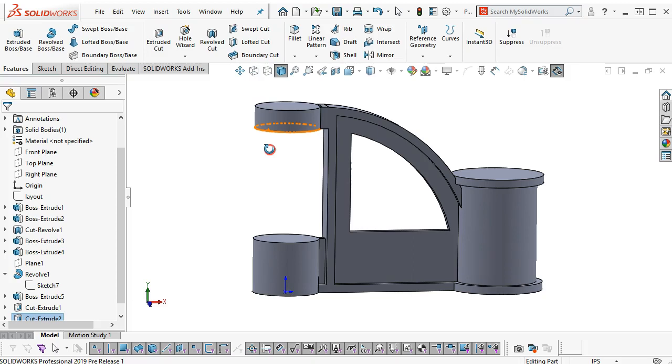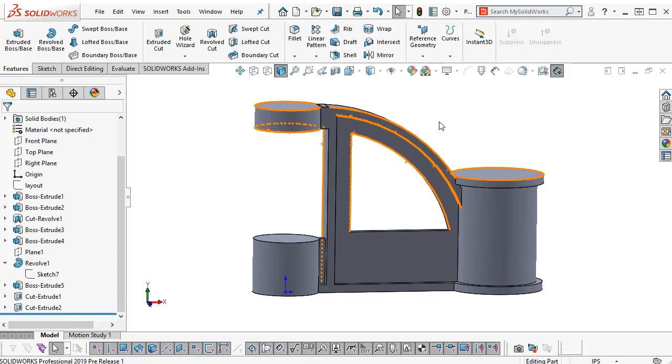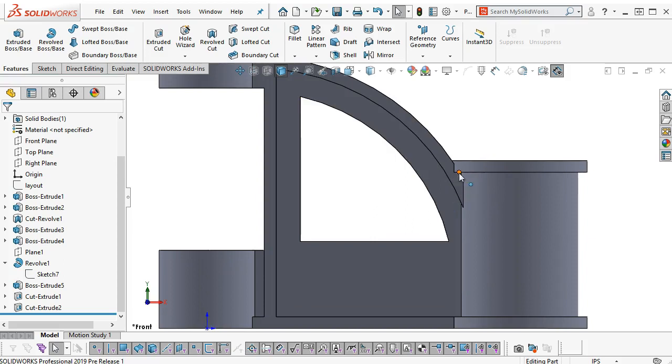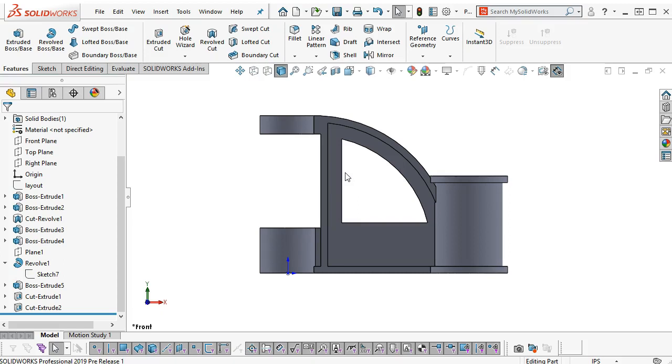Alright, so other than a few minor details, I think we're pretty good on our geometry. It would have been nice if this had come off tangent. Want to stay with that dimension at least for now. Since we're not given a center point, and bringing it back, yeah, it makes the connection, but then it doesn't when it passes through. So if the radius was all the way around, and if we had that 1/8 inch radius, that would probably close it off. Alright, so just doing kind of that double check as we go.